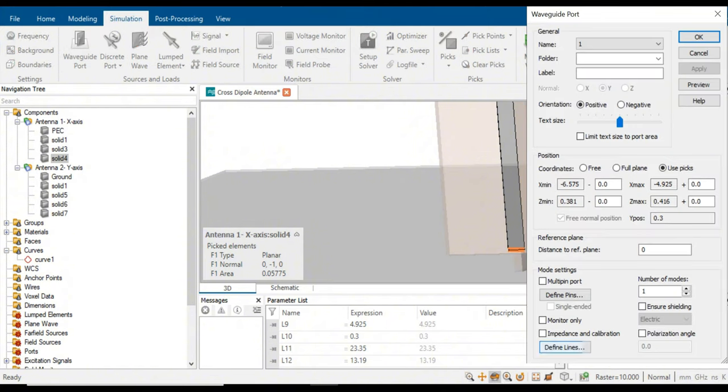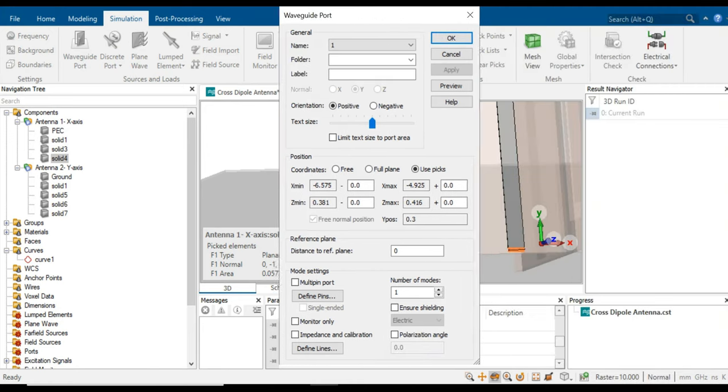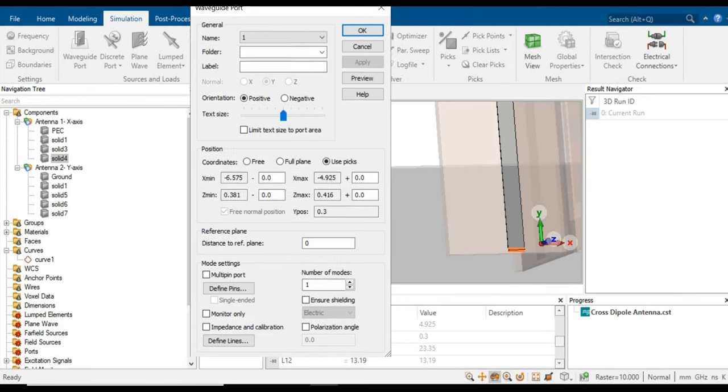A waveguide port should cover a space around the end of the transmission line. As a result, we need to specify these margins in the waveguide port settings. We apply a margin of 5×HS to the right, left, and top sides of the waveguide port. Moreover, the waveguide port covers the edge of the dielectric. To cover the bottom edge of the dielectric, we consider a margin of HS.